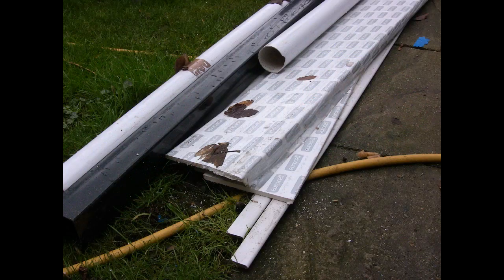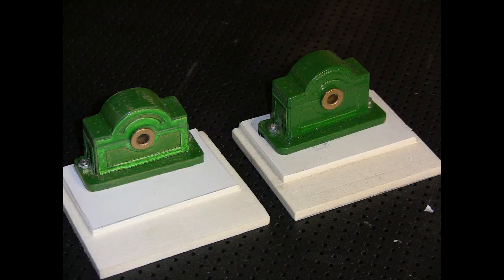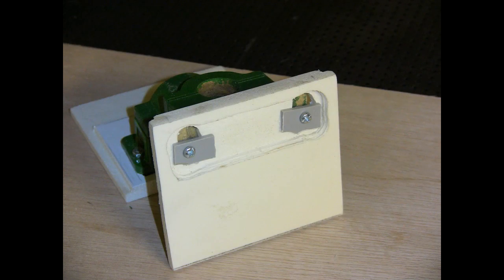The two bases there in white are just building plastic — I've used a router to shape them down a little bit. Remember what I said about making things adjustable wherever possible — the same applies here. The beam is going to be 27 and a half inches long pivoting between these bearings. If you move the bearing two or three thousandths of an inch, the end of the beam is going to be moving the best part of a millimetre or more. So here you can see my attempt at making them adjustable, so that we can get the end of the beam and the piston rod directly over the cylinder. Showing the inside of the bearing where I've drilled it out — we don't want a tiny little spindle an eighth of an inch in diameter. Two pieces of plastic tube from the inside of a till roll, with washers glued on either end and covered in self-adhesive aluminium foil, giving the impression that the axle for the beam is a much larger diameter. And there you see it in the bearings with the beam.